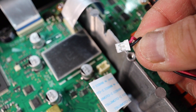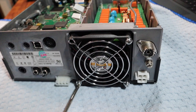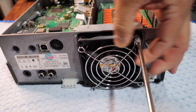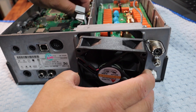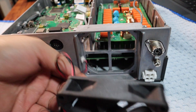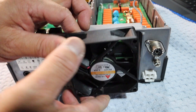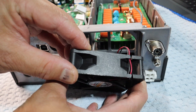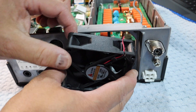I just pulled it straight out from the housing along with the wires. Keep note — we are placing this fan upside down right now because the radio is upside down. The key thing to note is we are checking the airflow arrow. Can you see the arrow right there? That's the airflow — the air is actually going out from the radio itself.